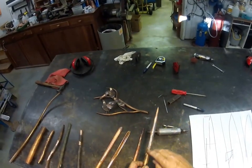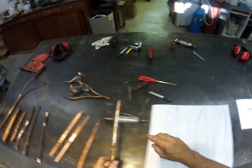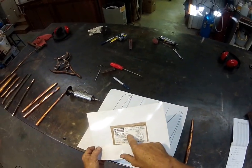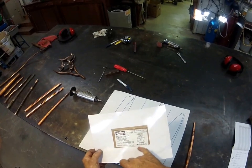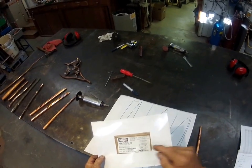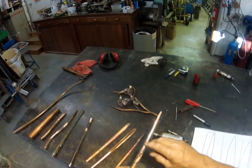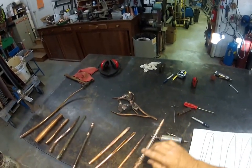When you're done, you're going to braze it. I say braze it as opposed to TIG weld it because 99% of you are not going to have a TIG welder in your back pocket. So we braze it with Harris Zero — the nomenclature is Harris Zero 050 by 1/8 inch. It's a flat stick. You can buy it in one pound tubes; I buy it in 25 pound boxes. It's the stuff to use. The only trick is it's going to be harder than the copper, so when you begin to grind it off — and you always have to grind it — there is no way to get a nice smooth finish right away. Get used to having lumpy finishes once you are fully brazed up.